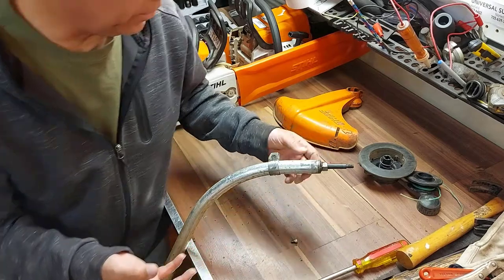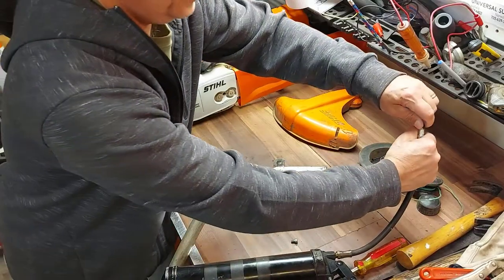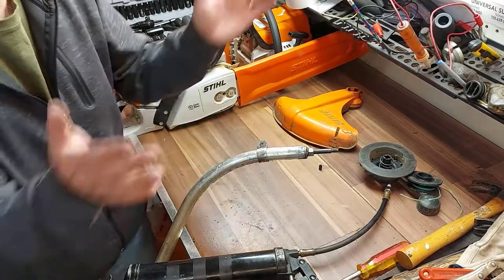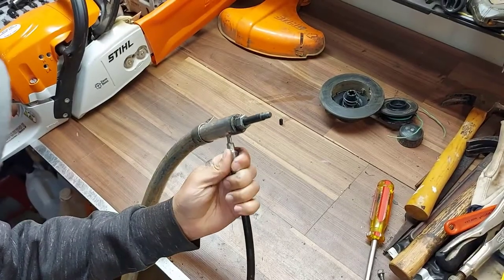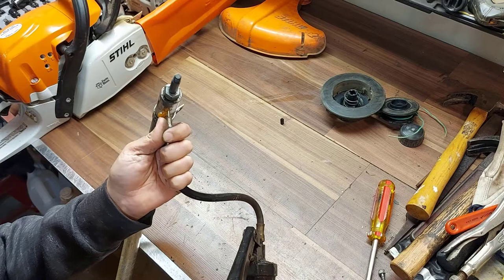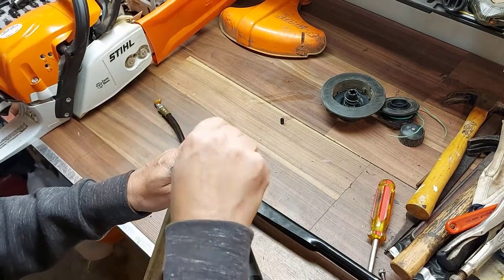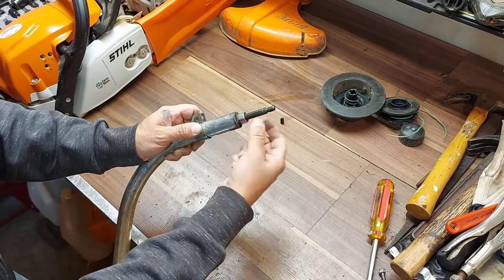I can't find my handheld grease gun, but luckily I have this tip here that I can use. I'll leave a link down in the description below where you can get a hand pump grease gun for this. So we're going to put the tip into the hole here and just pump some grease into it. As you can see, it's probably pretty full because the grease is coming out. I can feel the resistance from the grease in there now. So that's it — that's the hidden hole that you should grease, because you don't want this wearing out or else you have to replace the whole thing.